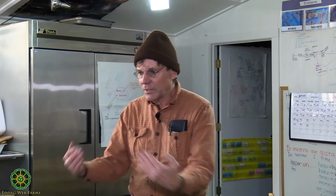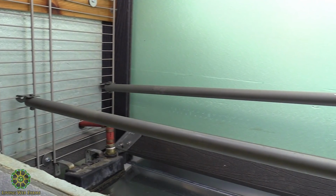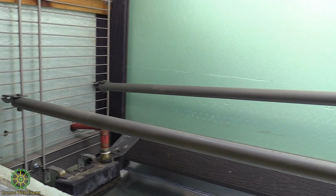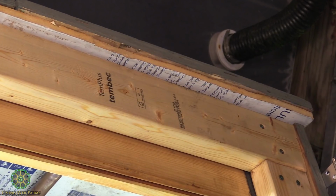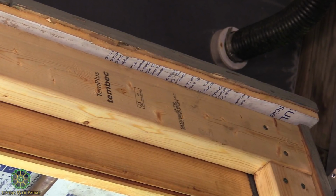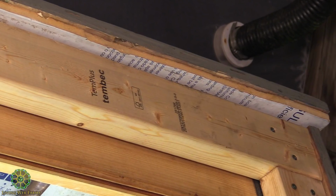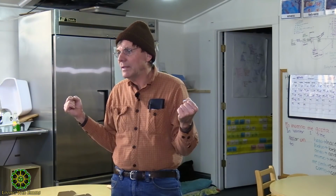So it really just has to seal that box completely. So the bottom is a water pan, and the sides and the front and back is an insulated wall that has some structural ability in the corners, and that's basically it. The top is just a sheet of cut-to-fit insulation, and on top of that I put a plywood surface because we have stuff up there. You have to put something durable up there because it will get punctured if you don't have something solid up there.